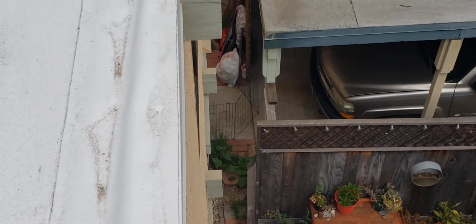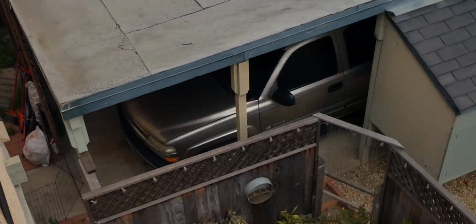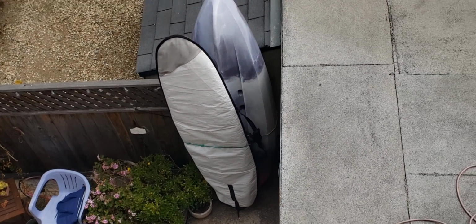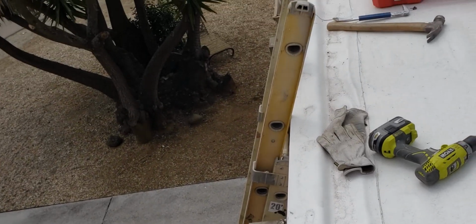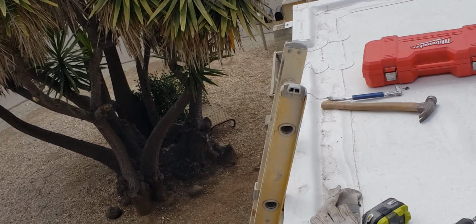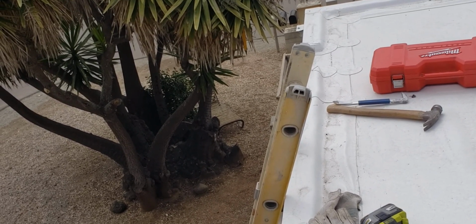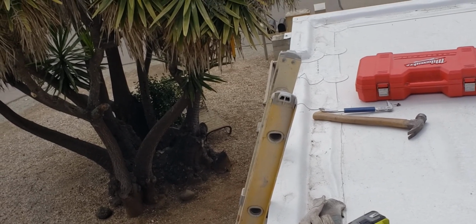Okay, so here we are. There's all these beams. They stick out from the stucco. There's 33 of them. I've got to cut those off. It's kind of slippery up here. The new roof on here is kind of wet. Anyway, so we're going to cut all these beams off, and then we have to take our router and route those back to the framing line. I call it the plate line. And afterwards, then my plastering contractor comes out and plasters them.